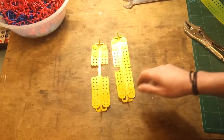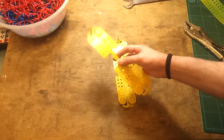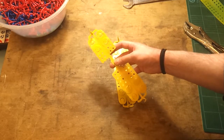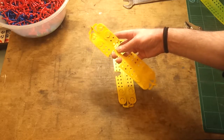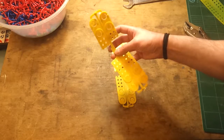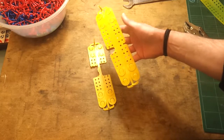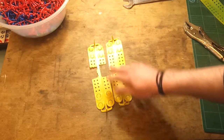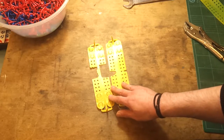When I'm doing coloured mouldings I try to be as efficient as possible. I listed these face mask straps on eBay and they've been selling a little bit more quickly than I expected, so I've had to run off another batch and I didn't write down the settings. My first few cycles I had short shots coming through — I needed a little bit more plastic, but I soon got that going. If I put too much in it would have just flashed over, but that's just a case of getting the shot weight right.